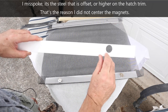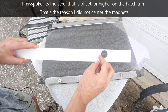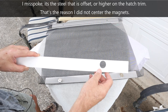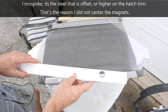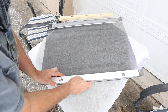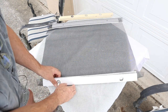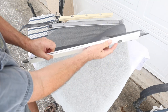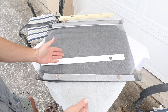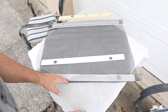You'll notice I took an offset of the magnet to the top. I did that because my frame — the magnet — is offset on my hatch. If you saw the hatch installation video, I put a steel surround and then covered that with marine vinyl. That's why these magnets will stick, so you'll need some steel for the magnets to stick to for this design. All I did here was take two pieces of that lattice, and on one of them I drilled a hole straight through — one inch. This is going to go on top of that piece, and those magnets protrude just a little bit, and I sandwiched the screen in between. I was halfway through the build when I decided this works really well, and I haven't finished doing it yet. So that's what we're going to do now — we're going to finish putting this together.